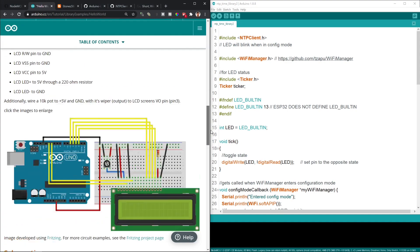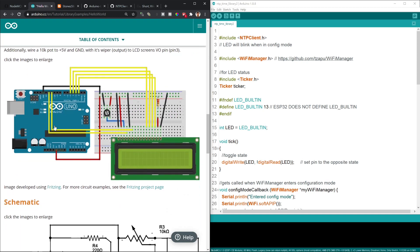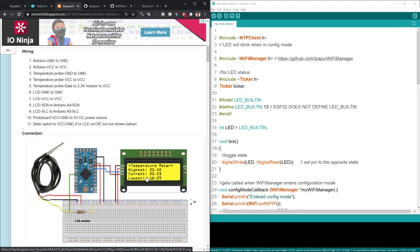This is the example you're going to find — one LCD with only two rows and 20 characters. The connection is quite complicated because it does not have an I2C module on the back. So I would like to go for the easier part. If you look at my previous project on my blog, here's the connection of the LCD to Arduino. You can see we only need four wires: GND, VCC, SDA, and SCL to get the display working.